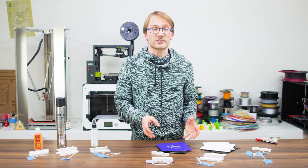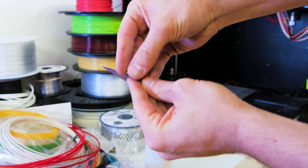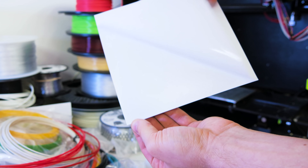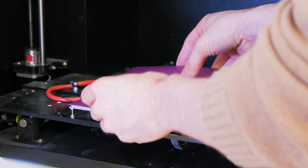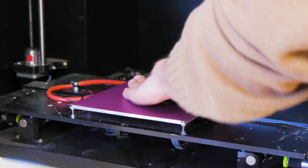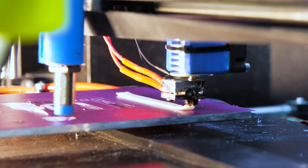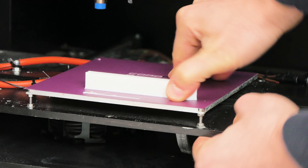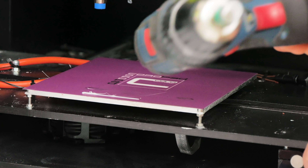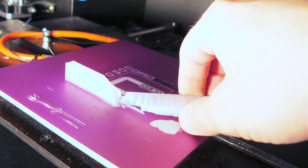Now moving on to the solids, starting with the Coropad. Just to get it out of the way — this thing is an absolute adhesion beast. I did correct for the extra 0.3mm of thickness the Coropad adds, but everything just stuck to it incredibly well, maybe even a bit too well. This surface is the only one I could see cold ABS printing happening with. Add a bit of a brim and maybe print the first layer a bit hotter and you could have some success getting compact ABS prints out with no heated bed. Cold PLA worked perfectly, cold PET showed some slight warp, but the really interesting tests are the heated prints — because each of them says 'bonded' as my remark for how easy it was to remove them. The PET print even stuck so well that it broke in half when I tried to remove it and it took a sizable chunk of the Coropad along with it.